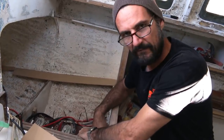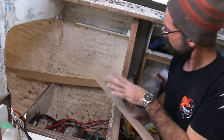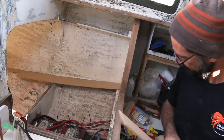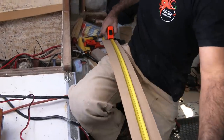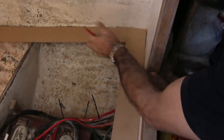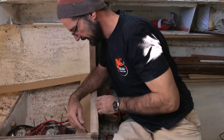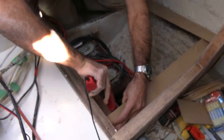As long as the corners of each side are in the corners where I want them, this only has to register against that surface and these take care of the other corners. So we'll just make that 700. Using a right angle to cut was totally unnecessary — the corners are already sorted out here, so all I need to do is put that down so that it contacts and lines up with the corners here. And there — the line is continuous — and there's our template.